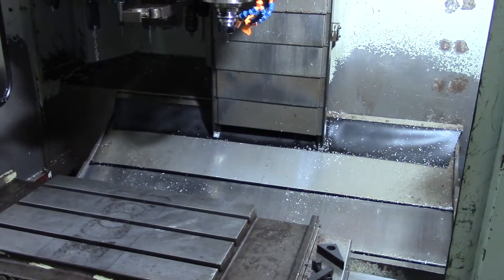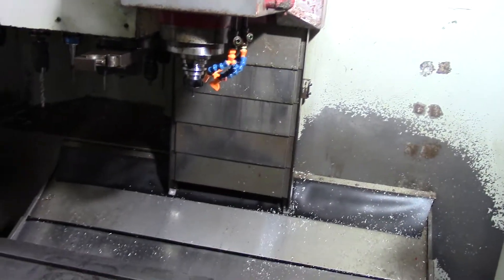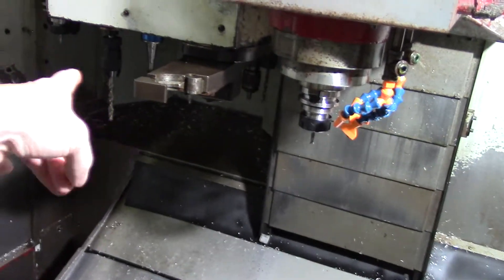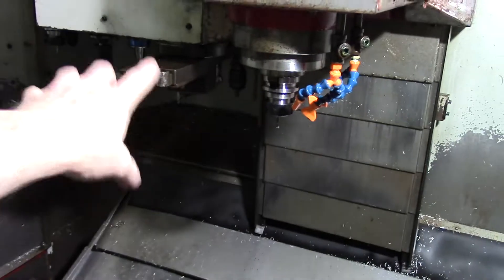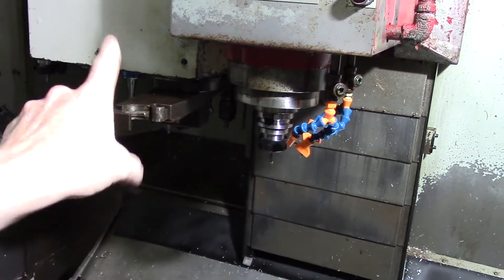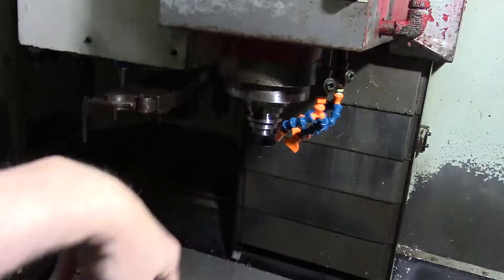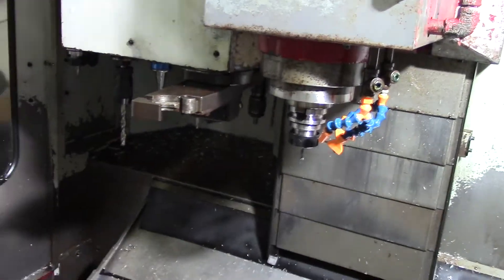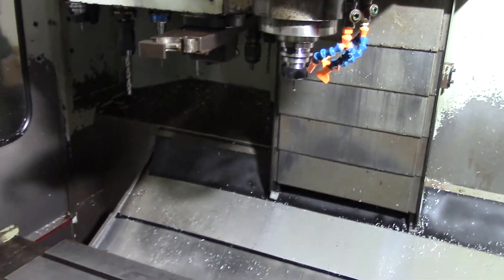With the LED up in the top corner it's really bright and pretty much covers the whole machine. I'll probably get a smaller version to set back in that upper corner too, so I can see what tool is about to be pushed out while watching the program. On this particular machine at 100% rapid, the only slow operation is the tool change itself — once it initiates it's going to finish, but you can stop the rapid if you pay attention and watch that tool get switched. If you don't notice what tool is in there until after the changer lets go, it's already too late — the spindle's going to drop and you'll likely have a problem.